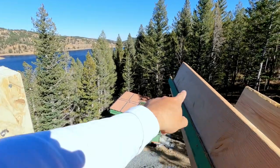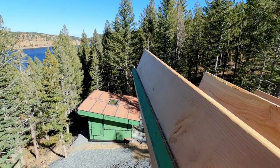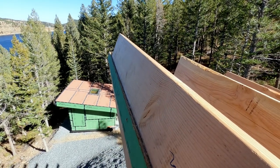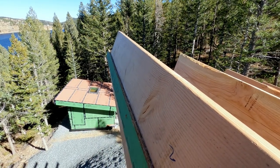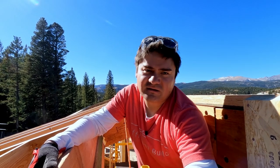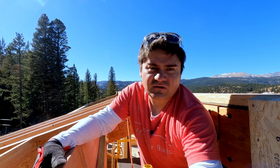The biggest concern is that I would be cutting so much of the 2x12 that I'm worried it might not meet the engineer's requirements anymore. So I'm just going to do the easy thing and the better thing — remove them. We'll use these 2x12s for blocking and just start over. I'm going to offset the layout so they don't fall on the connector. It is what it is.